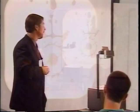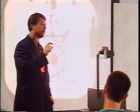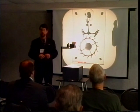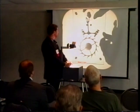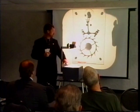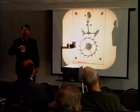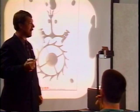Now, the other thing that I didn't mention yet is the relationship between fork horn clearance and guard pin clearance when we talk about the amount. Should one be more than the other, less than the other, equal? They can be equal. If we put the roller jewel here and look at the space between the fork horn and the roller jewel, or we move the roller table here and look at the space between the guard pin and the safety roller, what's that space? It doesn't have to be the same for any reason, but guard pin clearance should be less than fork horn clearance? Yes, less than, probably. Right. Now, lots of times in real life, they're equal.